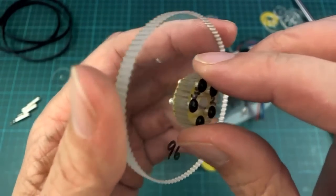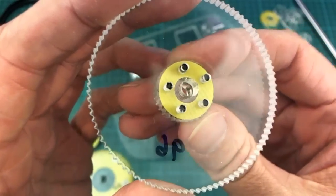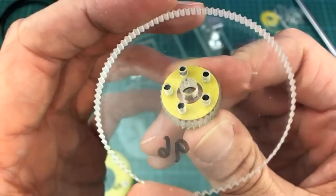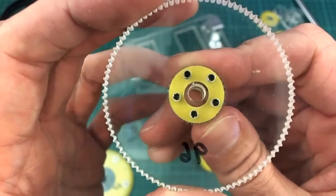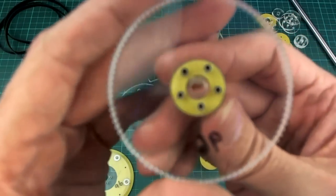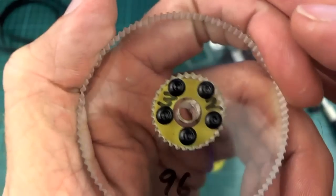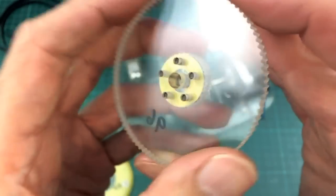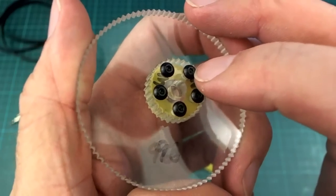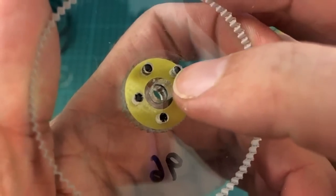It's just held together with five 2.5mm screws, and at the moment they're going directly into the acrylic. I found that you can get quite a nice, strong, secure connection just by making the hole in the acrylic a little bit small and then just driving the screw straight in. It's a little bit risky because it gets so tight in some places that I've actually stripped out the heads of these screws on more than one occasion. So I use a little bit of CRC 556 or WD-40 or whatever that stuff is, and that helps a little bit, but it's still a little bit risky. Fortunately, the acrylic has not cracked at these points like I thought it might.